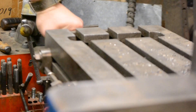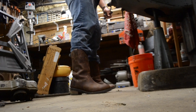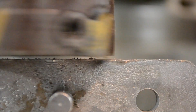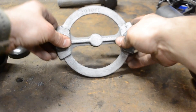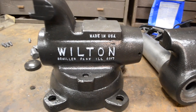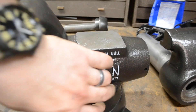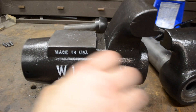You can see some other silly footwear that I occasionally wear in the shop — my cowboy boots were nearby. There's my Kurt vise using parallels to get the jaw set just to the right height, and there we go with some stock removal, just taking off a few thousandths at a time, leaving a really nice finish on top. If you don't have a Bridgeport and you do restoration work, if you can afford one and have the space, it really comes in handy. So now we're putting everything back together. The vise's swivel base is two parts — we just put the bolts through and attach the nuts on top. The nuts have that built-in handle that allows you to tighten everything down and position it where you want it. Those cleaned up really nice — they were really beat up, I may have done some additional work off-camera, I think I filed a few burrs off of them, but they turned out really nice.